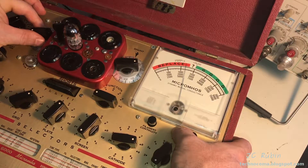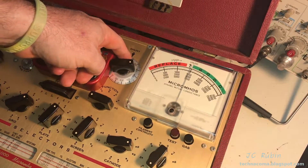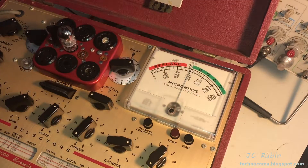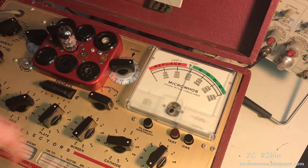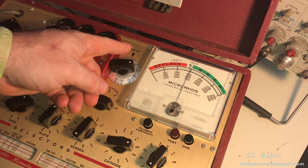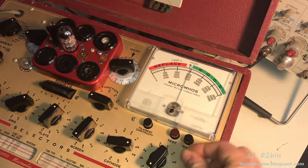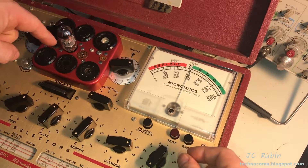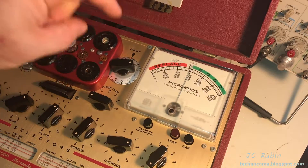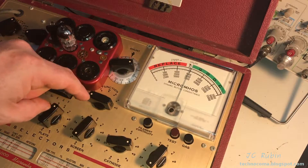The shunt movement corresponds roughly to the thickness of the dashes for needle deflection, while the bias is moving the needle three to four times as much. So if I had a choice of one upgrade on this unit — either fixed positions on the shunt for 3000, 6000, and 15,000, or a meter telling me the exact specified bias voltage — hands down I would choose the bias meter, because it has a much more profound effect on accuracy than the shunt does.